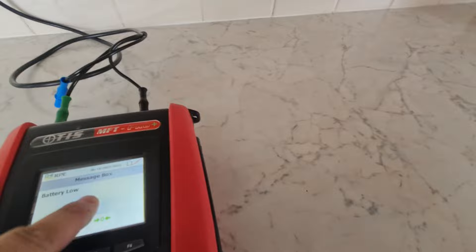Low battery on the test set, so going on charge. This property's been empty for about six months. If socket fronts are greasy or there's a poor contact, put the plug top in and out a few times to try and clean that connection up. As you move around the ring and go across different sides of the socket front, in and out just to make sure you're cleaning them up as best you can.